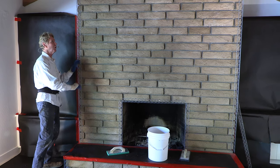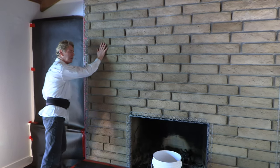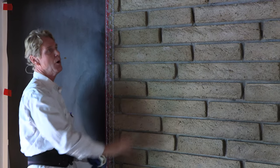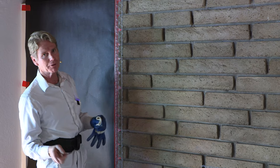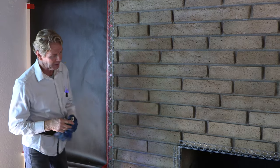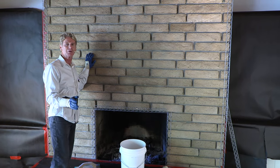I'll show you how to use that and what we've got to do. First, I've got to determine this — if you're working inside and it's pouring rain outside, touch the brick. This is the interior. I'm touching this brick and I feel it's warm, cold in some spots. So when I put the first coat on, we have to detect and get a formula for how much accelerator to put into our material. You don't need to put Wonder Board. You can't, guys. If somebody says that, call somebody else because they don't know what they're doing.